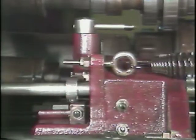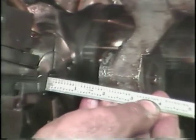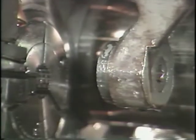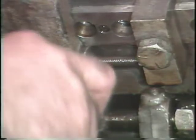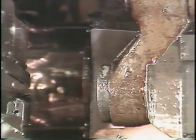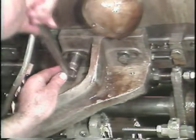The out of stock light will come on and the machine will stop at the end of cycle. You are now ready to adjust the stock stop — this must be done with care to get the exact amount of feed. The stock stop is adjusted by loosening the two holding bolts on the stock stop bracket. Take a measurement from the outside of the cutoff blade to the inside of the stock stop and move the stop backward or forward. Fine adjustments can be made by turning the adjusting screw. You can check your measurement by pushing a bar of stock into the stock stop. When the proper amount of feed is achieved, lock down the holding bolts on the stock stop.